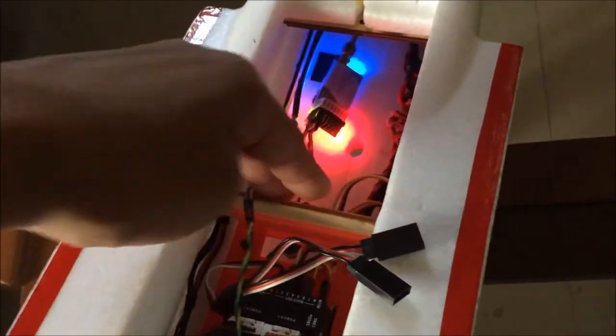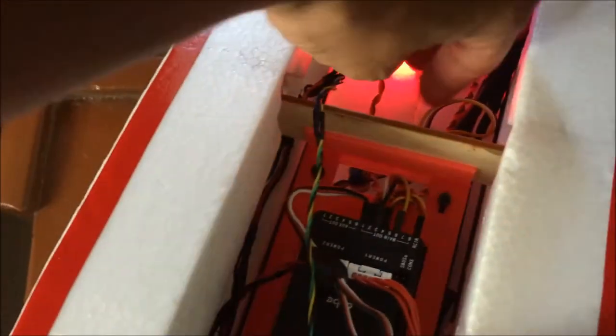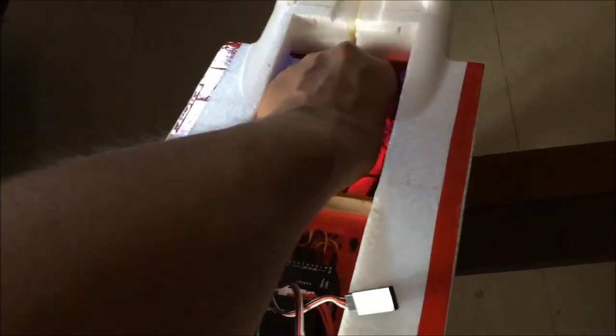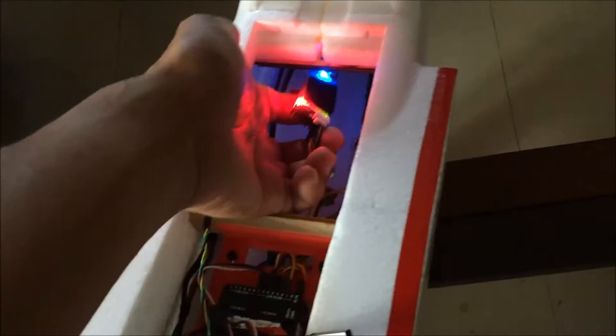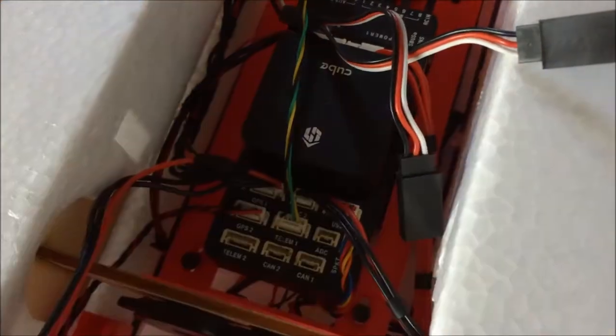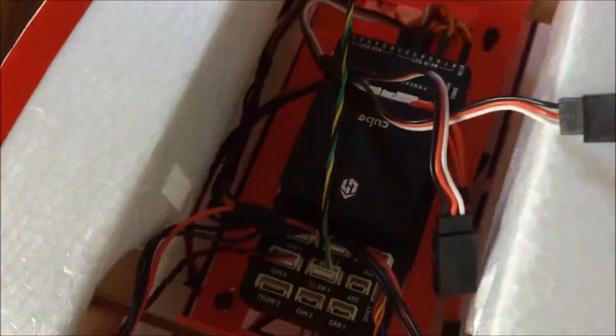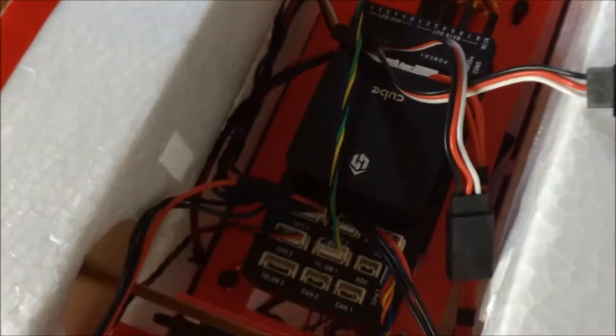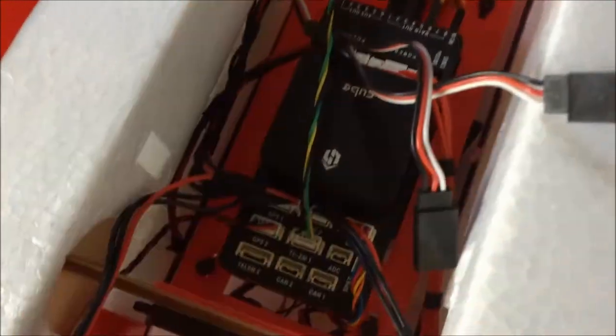You may also notice that my receiver is already connected to my Pixhawk RCIN for the PPM one-wire signal, and also the UXP connector — for the serial in and serial out of the Dragon Link receiver module — is now connected to my Pixhawk through telemetry port 1. You have the option to use telemetry port 2 or even GPS port 2 for connecting the Dragon Link MAVLink, but I use telemetry port 1 since I'm reserving the other serial ports for my other devices.